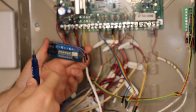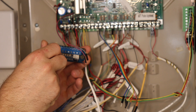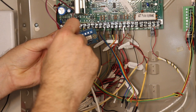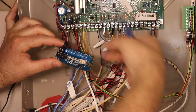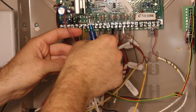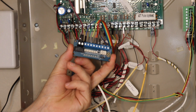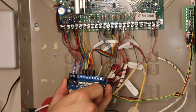Make sure you open the screw terminals completely before inserting the wire, then insert the wire and tighten it down so the connector bites onto it. We've got our voltage reference connected, and now I'll hook up zones 1 through 6 in the same way. The interface module is all hooked up with voltage reference and six zones. We'll get to the relay part a little bit later.